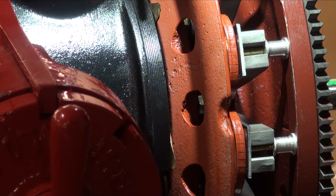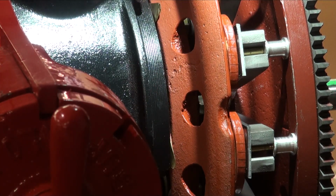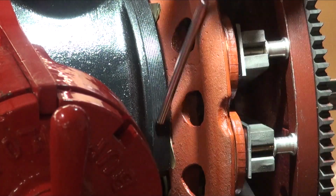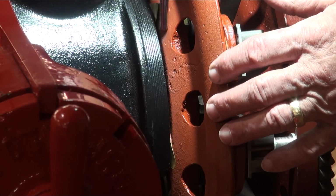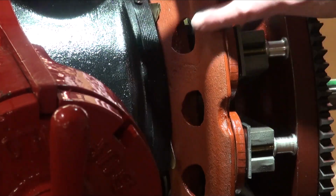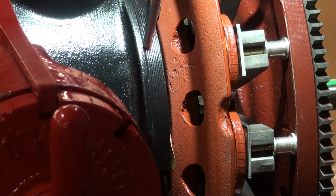These little tabs that we see sticking out right here are actually the shims, the shim packs and the parts of the shims. If you got 2 or 3 loose or separated ones, then they can fold over. And this area right here is where the felt seal, or gasket, goes, and then the hogshead sits down right in this area. Terry pointed out that it might be a good idea to fold these tabs back in along the field coil rather than leaving them stick out. On one side, they're a good thing to help hold that felt in place. On the bad side, he says, when you put the hogshead on, it tends to want to fold those things over and get on top of the felt and interrupt the seal between the hogshead and that felt.